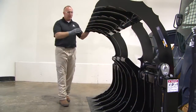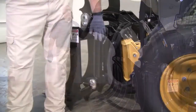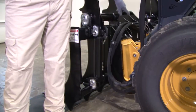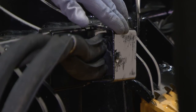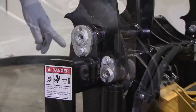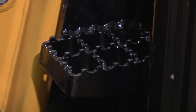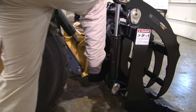This root rake has a 51 inch opening that will easily allow you to pick up 48 inch logs. Two hydraulic cylinders exert the clamping force and a pilot-operated check valve locks the clamp into position. The grapple opening will not increase or decrease once the operator releases the control. The grease zerts are recessed for protection. A heavy-duty step has been placed conveniently on the frame of the attachment, making entry and exit from the machine simple and easy.